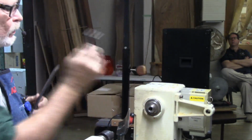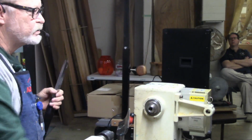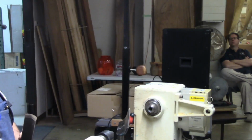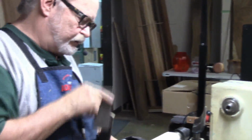And the way you hone, as a carver, we put our stones down. And I got around serious turners. They didn't put the stone down. They got steady with the tool. They moved the hone. Totally different concept of honing. And what I'm using is the hollow grind to function as a jig. I am using a jig. Because when I have a 2-point contact over a concave, I transferred the radius of the wheel. That's honing.